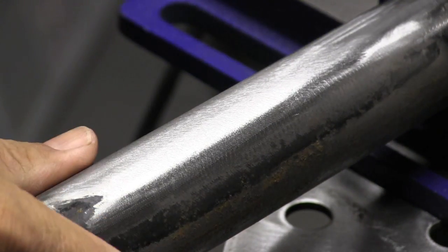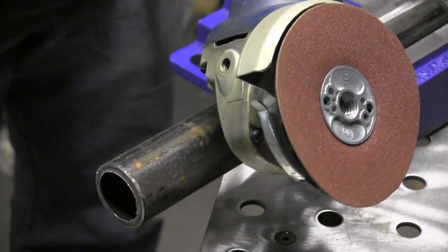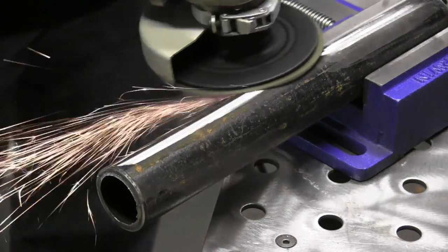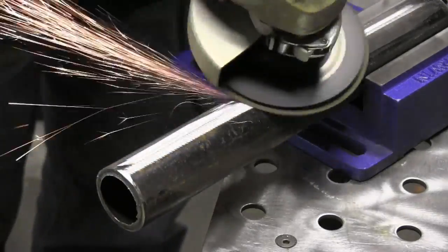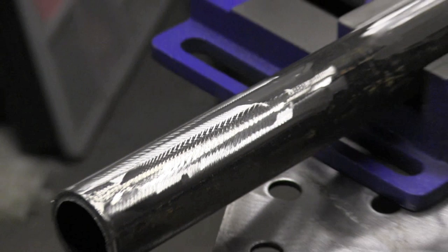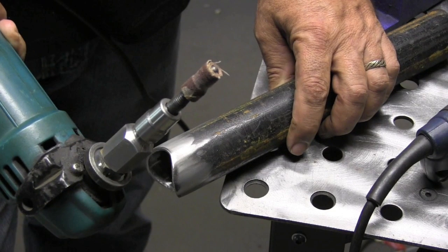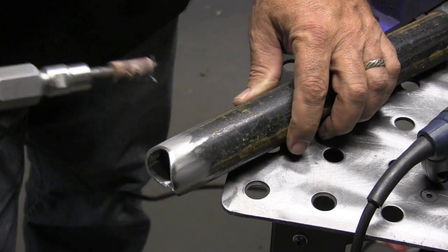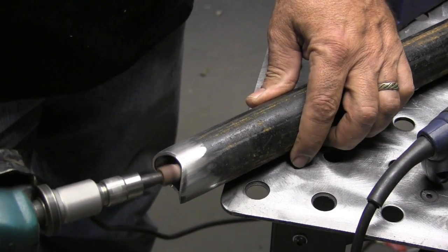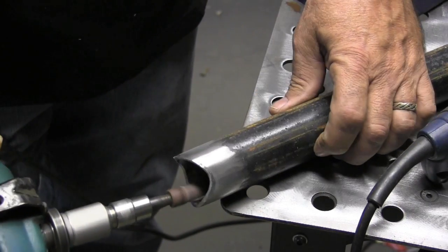The 3M bristle disc does a really good job if you've got a lot of coating to remove and you need a nice smooth matte finish without removing much material. This is just a regular old sanding disc with a flex pad, about 80 grit — does a good job but the edges tend to load up with coatings. For cleaning out the inside diameter of a pipe or tube, there's this little flapper adapter that converts a small angle grinder so you can use bits with small abrasive cartridges.